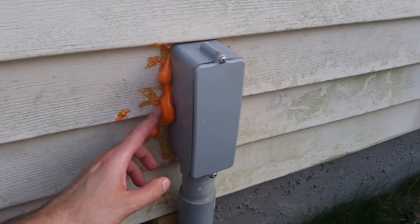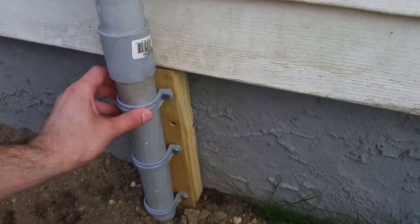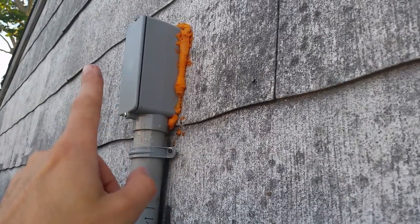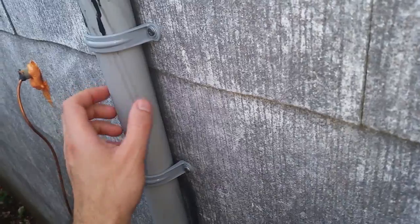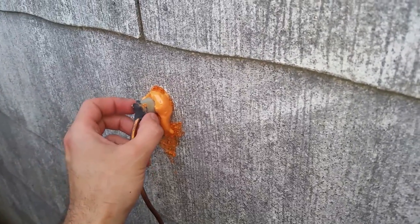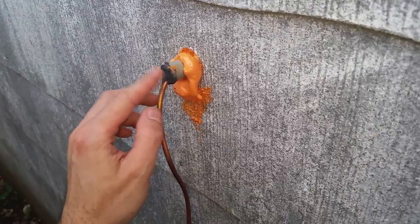On the outside of the house, you use a fitting with a hole saw to penetrate the wall and run conduit into the ground. I dug a trench all the way to the garage. At the back of the garage, a similar fitting lets you pull the cable through — have someone pull it in from inside the garage. Seal with fire-retardant foam and duct putty. I used schedule 40 conduit going down into the ground — check local codes, as schedule 80 or metal conduit may be required in your area.